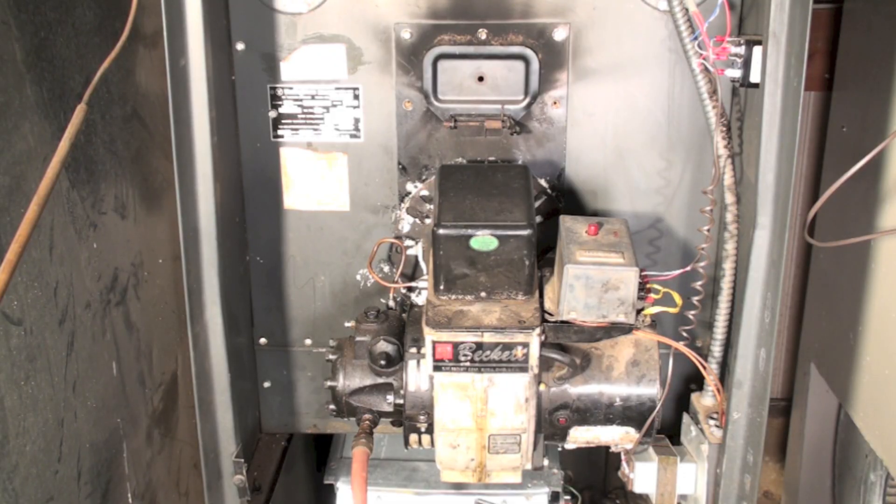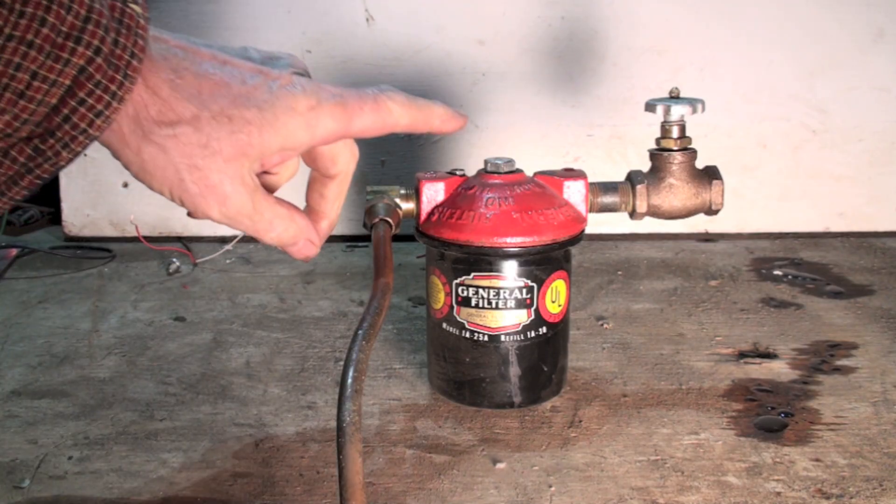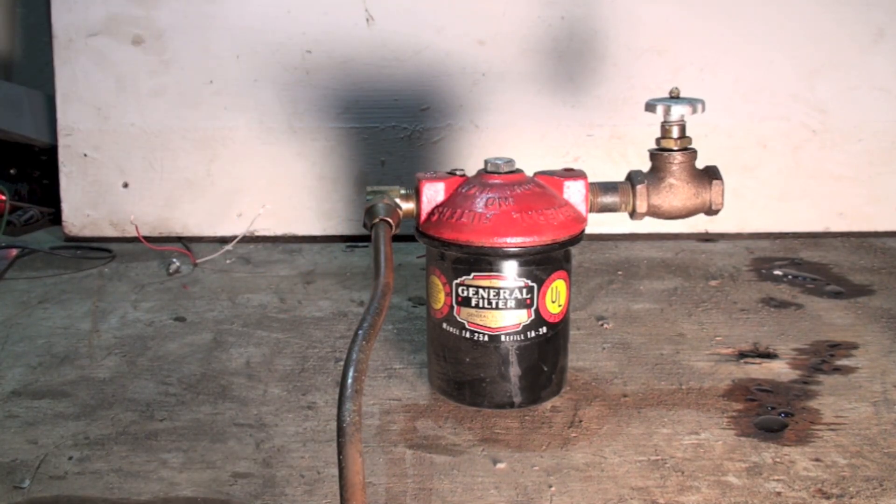So what's going on? Well, first thing we can try a little bit of a bleed. This is probably the problem that you're having. Now this isn't connected up to the oil tank, but this is your filter here. What you're going to have to do is pull it open, replace your filter, and clean out the canister. I'm going to link a video on doing that and bleeding it out.